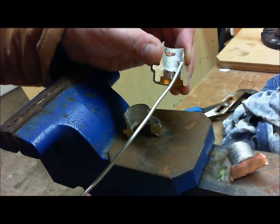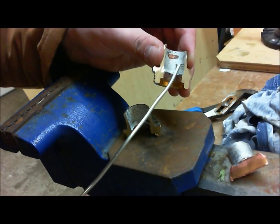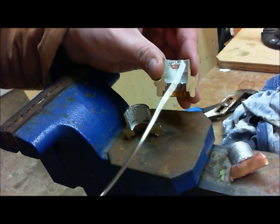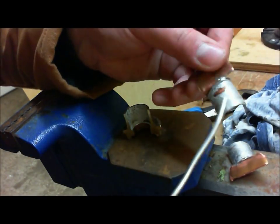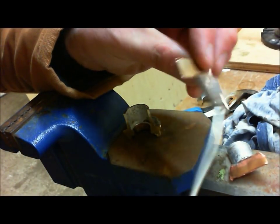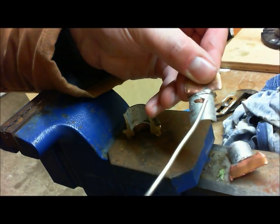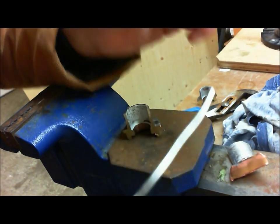The lines you see here are just pieces of, when the pipe went down in here, it just kind of put some flux in a radial pattern, but that is still 100% covered here. But overall, it's very good, but it's not perfect. This can be done better. If we look at the piece of copper that this came out of, again, see we have total copper coverage. See, here's the copper, right? Here's our bare spot. Now, because I have this much between the water here and the final non-solder point here, again, it's a very good joint. We are very much considered waterproof at this point.